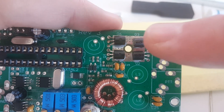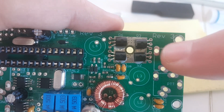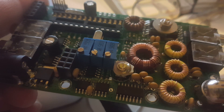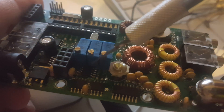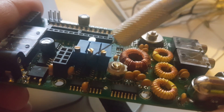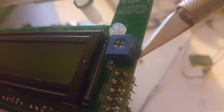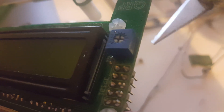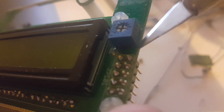There's a washer that's going to come on top and pin them against the board. Something you really have to pay attention to is the manual. For instance, at the base of those potentiometers you have to cut off the little plastic tabs. I did that, but you also have to cut the little tabs at the bottom of this potentiometer on the display board, which I forgot to do. So now I have to unsolder this, cut the tabs at the base, and resolder it — and that's a real pain.